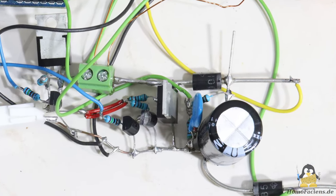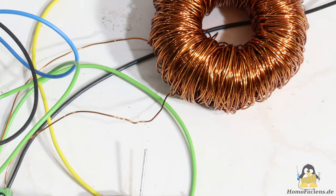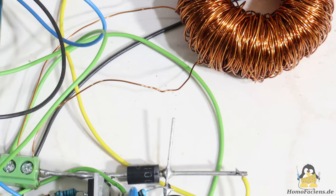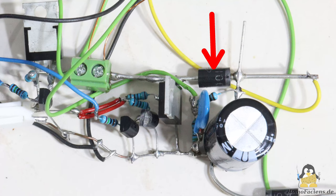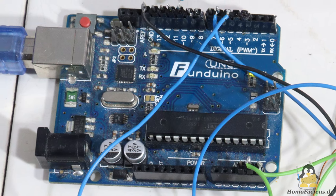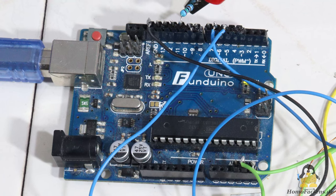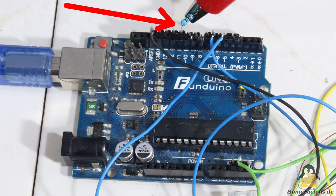The core components of the circuit are an electrolytic capacitor that is charged to the output voltage, a self-wound coil charged to the desired value via induction voltage when being switched on and off, an N-channel MOSFET that is used to control the current flow through the coil, and a diode which causes the higher output voltage to be isolated from the lower input voltage. The switching on and off of the MOSFET and thus the coil current is done by a microcontroller board with an ATmega 328P chip. The firmware consists of just a few lines of code that make sure the capacitor is only charged to the intended output voltage. A signal can be output to the CNC machine via a pin which indicates whether the output voltage has been reached or not.